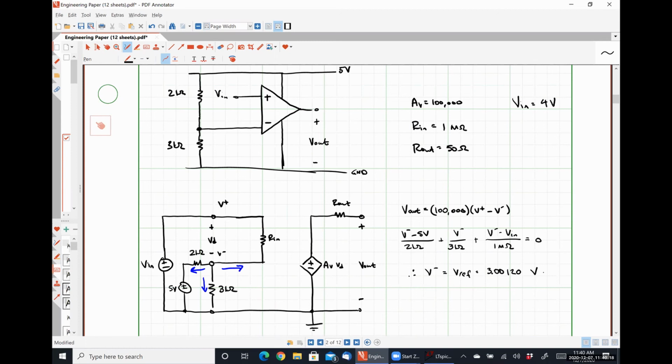We actually want to make sure that we use everything in the kilo ohm range because that's significantly larger than what we should see for any reasonable output resistance, and it's significantly smaller than what we should see for any practical input resistance. So that's the sweet spot. The kilo ohm range of resistors is really the sweet spot for biasing general purpose operational amplifiers. Okay. Yes, sir. Just trying to make sure I understand. So you're saying that we want the range to be significantly higher than 50 ohms and significantly lower than 1 megaohm.